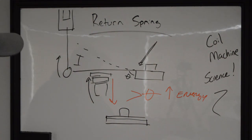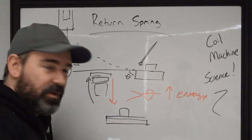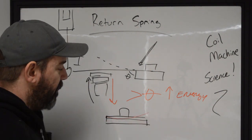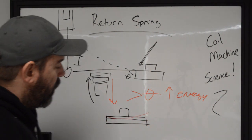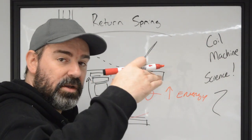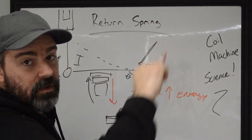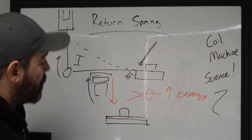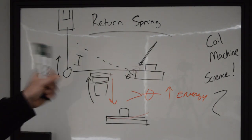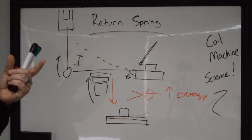spring. More often than not, when we're messing around with stuff, using our fingers to bend it, what you're going to end up having happen is this is going to have a bit of a bend to it, or twist or a warp. So if you have that spring and it's not perfectly flat and adjusted to be straight, then when it's being pulled down, you'll get this oscillation, however minute that it is, in the back end, which will cause premature wear on that static point where the spring is interacting with the rear, whatever that is, the rear post.